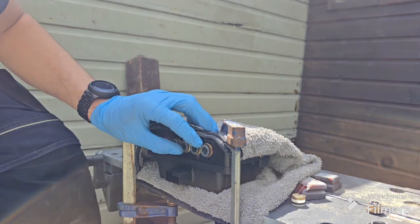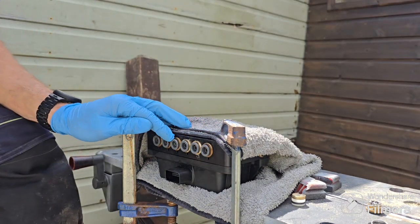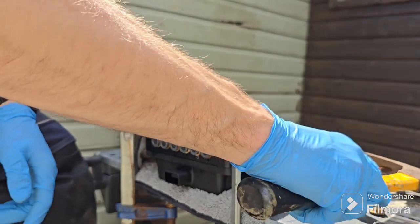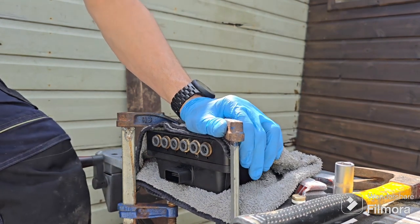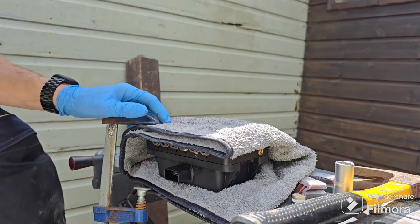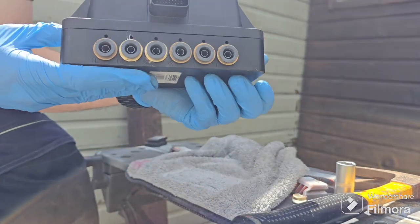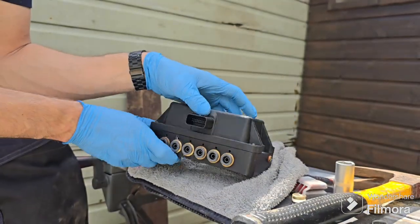Make sure there's no gaps between the metal collar and the manifold, and if it's in, you're all good to go. Release your clamps, put it back in your vehicle. When you do reconnect it up, airlift say that you should cut the ends of your airline from where they were previously inserted just to make sure that there's a nice tight seal. Make sure the pipes are cut straight and all the rest of it. Have a good day. I hope this was helpful. See you soon.